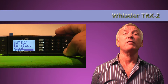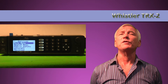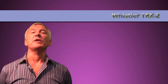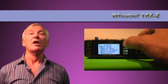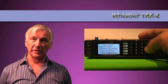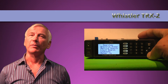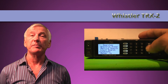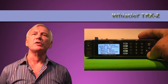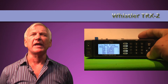The 146, 220, 420, 440, and 900 MHz bands waste so much scanning time — the chances of stopping on anything useful are nil. So the only real search facility for UK users is the limit search, where you enter a low and a high frequency and it searches between them. In the menu past search there are other parameters — 'delay 0.1s' is a strange one; this allows you to set the number of tenth-seconds the unit waits before moving on, so 50 equals five seconds.